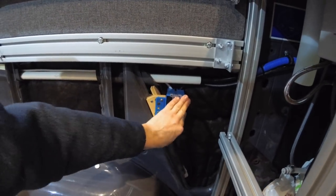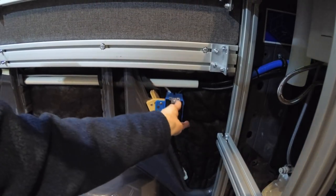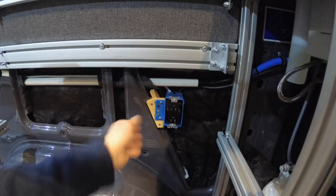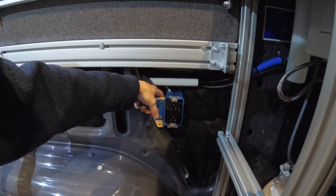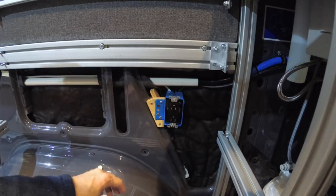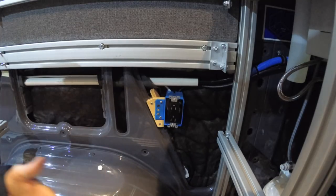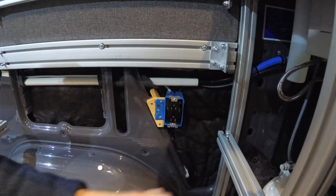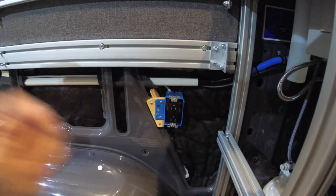I had to get a little creative in mounting these boxes because I've had trouble with flimsy boxes — I don't like plugging something in and having the box move. So I have them supported in the back. Attaching to the 8020 extrusion is really easy: I just put a couple holes on the side of the box, put a T-nut in the slot, and bolted it straight up, which made it really firm.